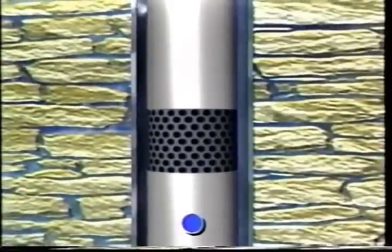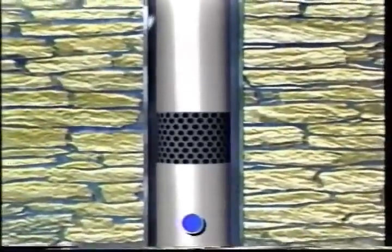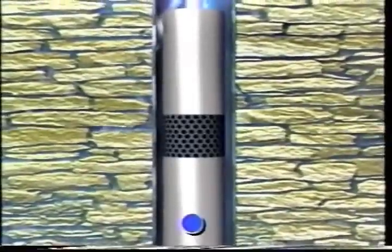To show how a typical water system works, let's follow a drop of water on its journey from the aquifer to the home. Here is the water drop deep underground. It has been moving slowly through the formations for a few years since it first entered the ground as a raindrop. Right now there is very little movement of groundwater in this aquifer. Now what happens when the tap is turned on? At first the water comes from the pressure tank where it is stored, but as more is used the pressure switch starts the submersible pump. When the pump switches on, our water drop moves from cracks and fissures in the formation, through the well screen, and into the well.